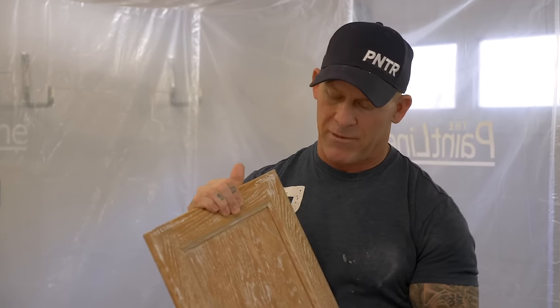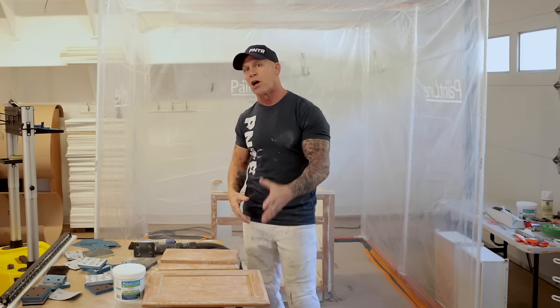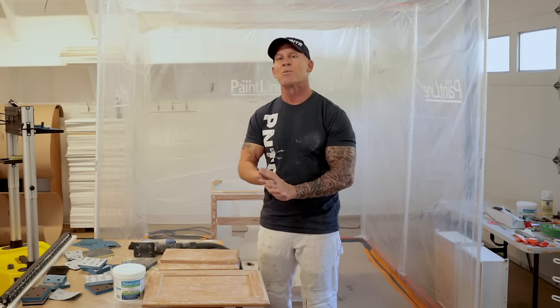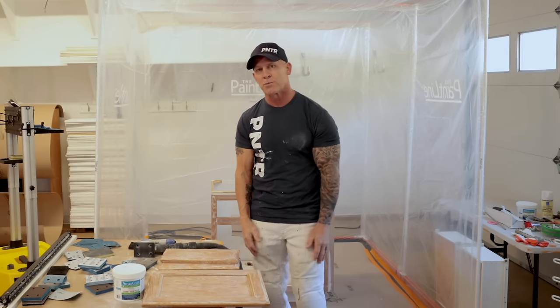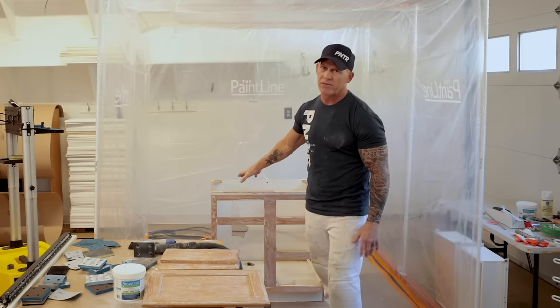previously painted cabinets have paint bridging over the gaps, and if you're painting them white, it could look really ugly. So are you gonna be caulking them? Make sure you use the right caulking, make sure you use the right top coat, make sure you're in the right climate, and then make sure you charge for it, because it is additional work. It is time consuming to get it nice, neat, and tight. So once again, I charge $10 per door or drawer. And if there's any type of caulking on the face frames or the side panels, that would be included in the door or drawer front price.